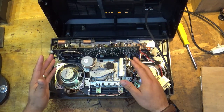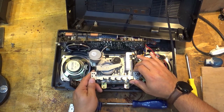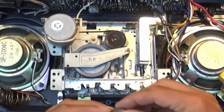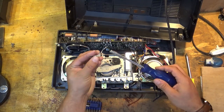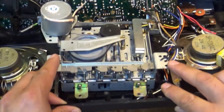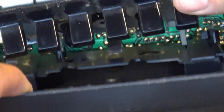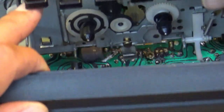Next mission: knowing the state of the cassette player mechanism, we should just see if we can pop that out. Removing these mechanisms is particularly difficult and quite complicated - there's an awful lot of springs and screws and bits of sliding metal. If you get it wrong and can't put it back together again afterwards, you will have cream crackered it. As a kid they called me the little wrecker because I'd take things apart and never figure out how to get them back together. Now we can blow all the crap out with a bit of compressed air.